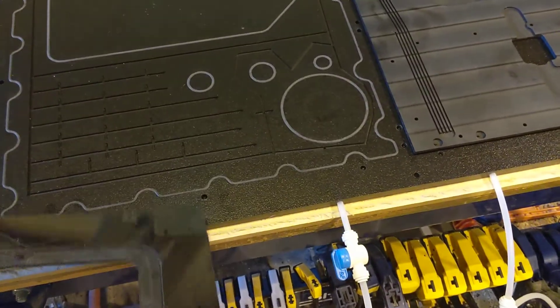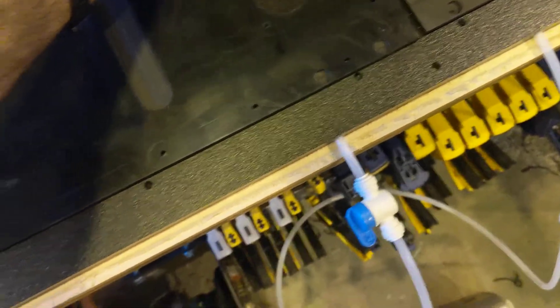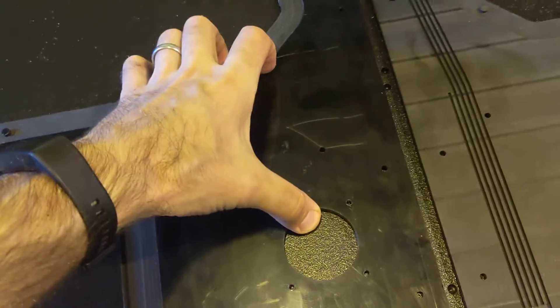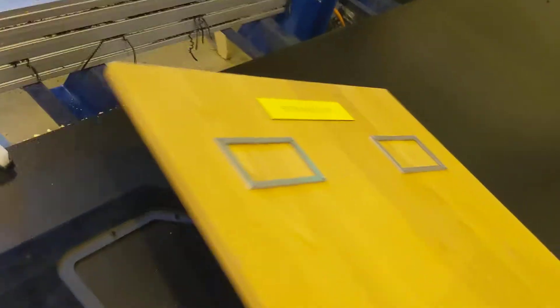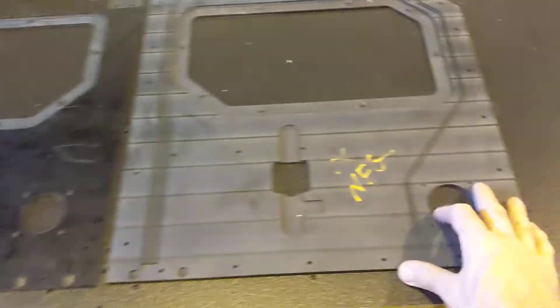There's that on both sides and there'll be some locating pins here to get these things just right. So you put the pieces on here like this, and you'd have the locating pins, then we kick on our vacuum — and they don't stick down until we get our special piece of heavy oak panel. Seal everything down, push that off. Now these things are totally tight on here.